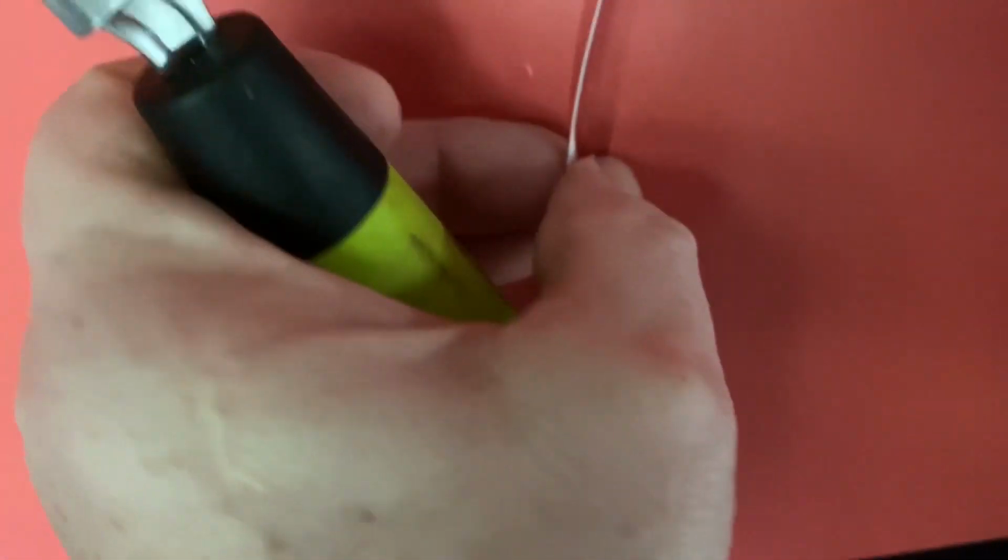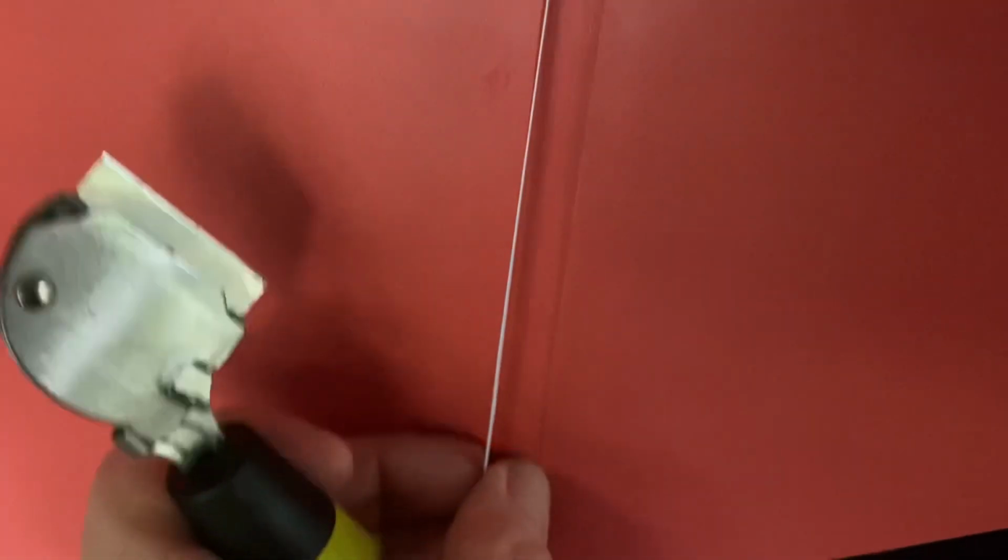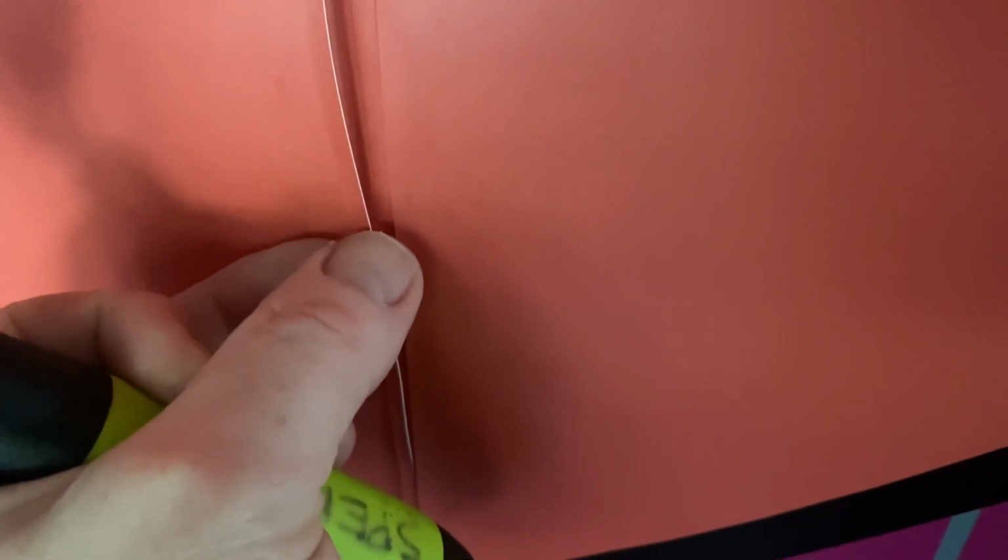You're slicing some of the top of it off, but it can be covered because the other side of that seam, you've cut it at an angle whereby the top of the opposite side can slide over it. But what happens is, since this stuff is vinyl and it moves and it's slippery as it's setting up after you leave that seam alone and move on in the job, it never meets up. You'll be off a hair, and we're only speaking about a hair when we're talking about these seams. When you cut straight through, you eliminate the silliness of this issue. Easier said than done, I get it.